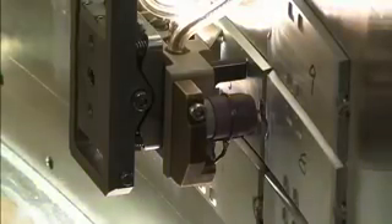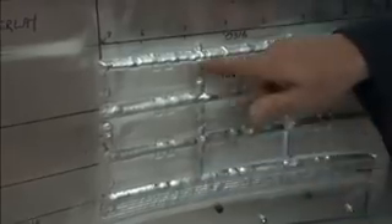For the final repair, there are nine plates — three columns of three plates. The first weld operation is to attach these plates with two tack welds on the outside. After the plates are positioned, then we apply some additional tack welds at the cross points between the plates, and then we perform vertical groove welds and vertical fillet welds on the outside.